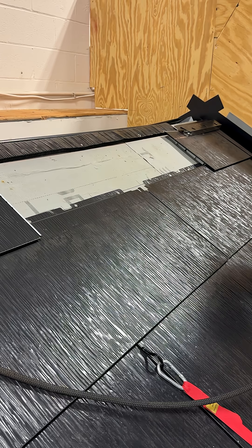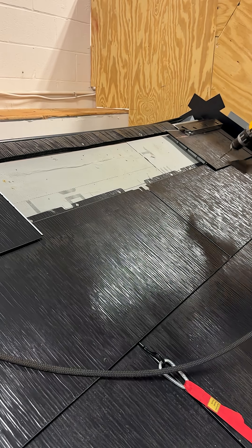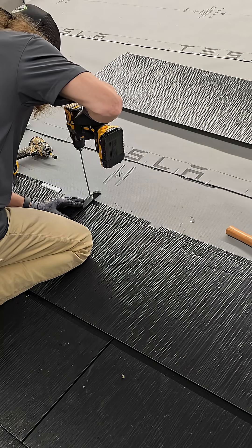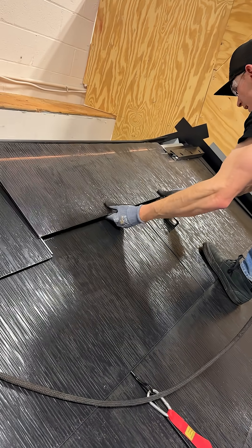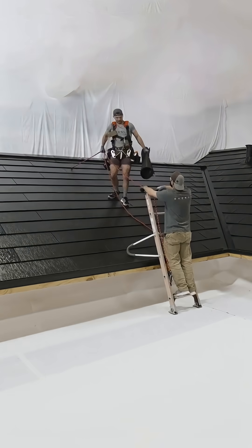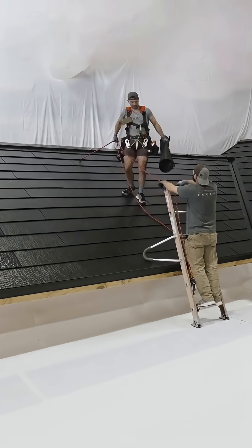When identifying the right place for an assisted access point, the lower tile should be either a metal tile or non-PV glass tile, and the upper a metal tile. If placed directly above a PV tile, it would shade the solar cells and impact total power production.